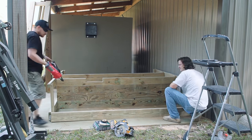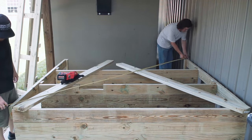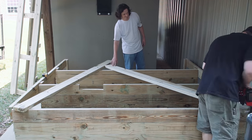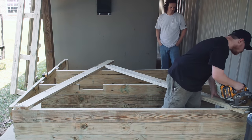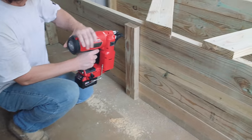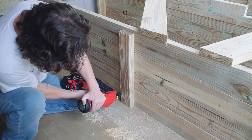We realized that laying it down would have made the entire process a lot easier — we had to lay it down to put the top shelf on. So the top shelf is installed first, followed by the diagonal bracing. The bracing is added after measuring corner to corner to verify the assembly is square. I wanted the bracing to be symmetrical, but the air vent was in the way so we had to skew them slightly. Three nails per attachment point and a quick trim of the excess with a circular saw. The middle shelf supports are then nailed on from below to lock the shelf boards together rather than having them support weight individually.